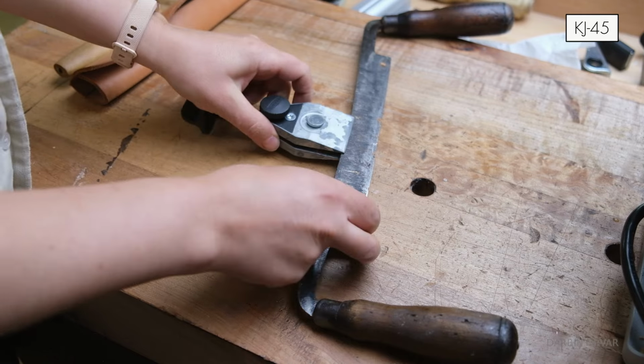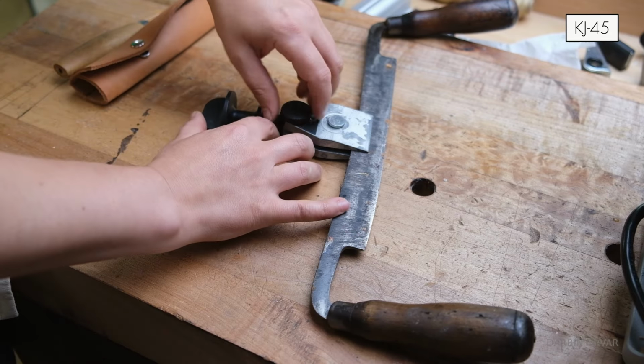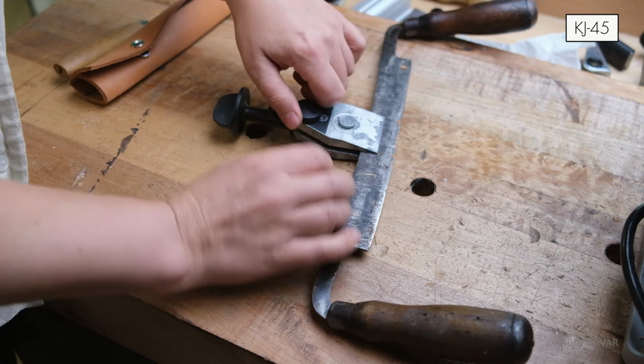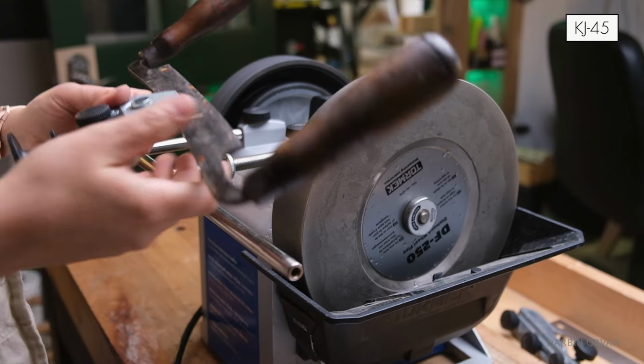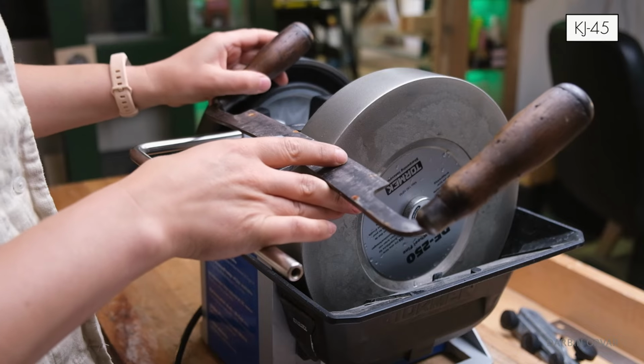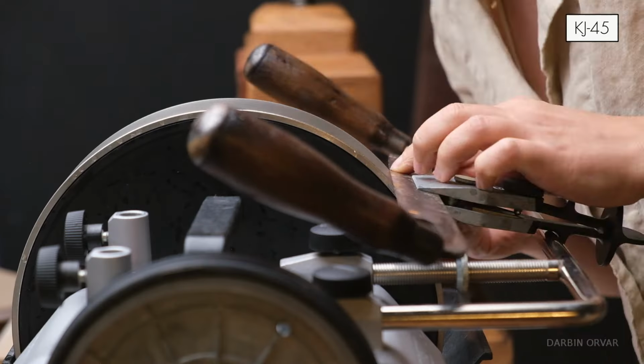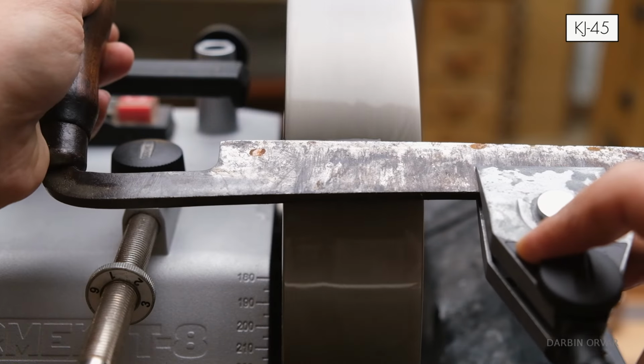And this jig basically just clamps onto the back of whatever tool you're sharpening, be it a draw knife or a regular knife, you know, a chef's knife you can use. Then the jig leans onto the support, and here I realize it is so long I need to remove the honing wheel so as to not butt into it. Finding the angle and then slowly moving across.